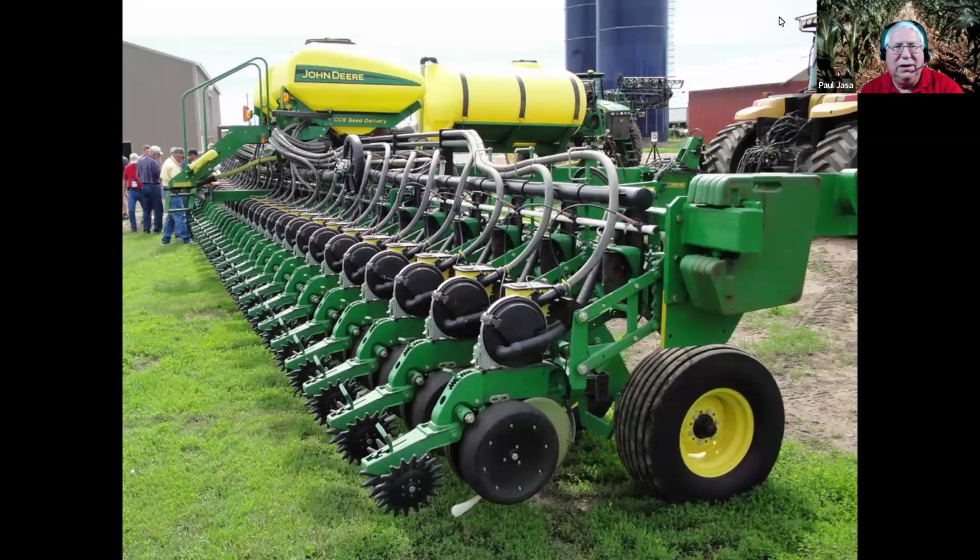I hit a new problem that I didn't have back there in the 80s. RTK and auto steer. We're buying planters without markers. Markers added weight to the toolbar. Central seed hoppers. We're carrying an eighth of a bushel of seed perhaps on each row unit. I like that fact actually because then your weight is constant going across the field on the row unit. What I don't like is those big boxes that John Deere had for a while that held 3 bushels of soybean seed. With 3 bushels of soybean seed, the planter was 180 pounds heavier per row when you were full compared to when it was empty. How do you set that down pressure? Well, with the central seed hopper there and only carrying an eighth of a bushel, those airbags can work a lot more consistently there.